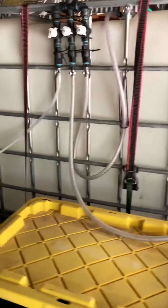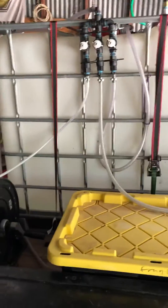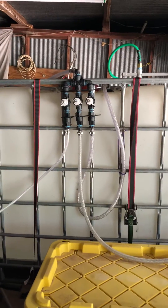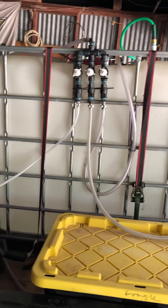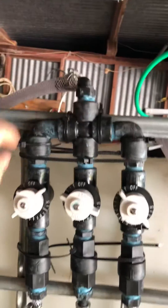The reason why you want to have drop sticks is because after each job you can drop the stick into a five-gallon bucket of water and help flush out your pump, which will improve the life of your pump tremendously. So you have that set up.